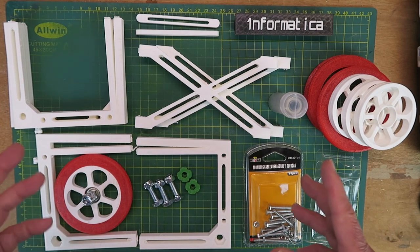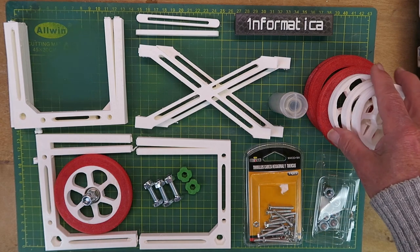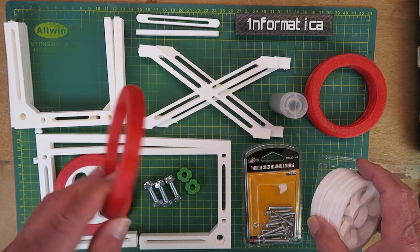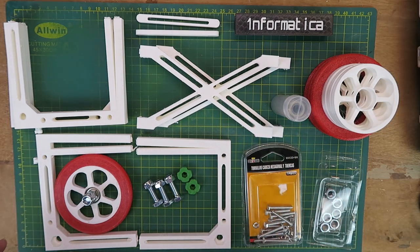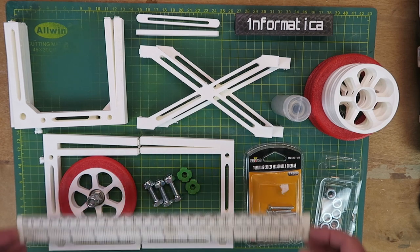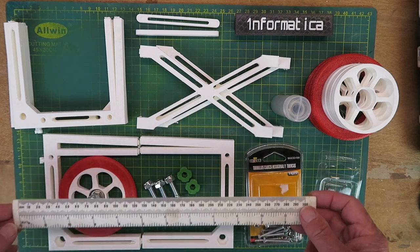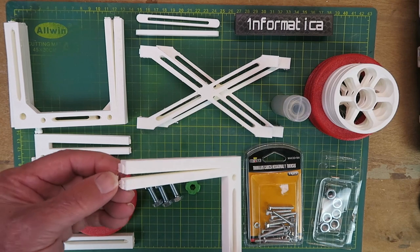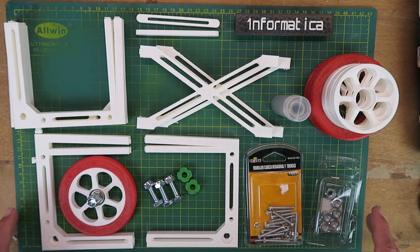Here are all our ingredients - I sound like one of those cooks off of the interminable cooking programs which I detest. However, I've printed off all the parts that we need. We have our wheels here. I've printed the tyres out of flexible PLA - you could also use TPU. I have my bearings here, the cross pieces, and the various other hardware that we're going to need. You'll notice that I've printed this in two sections. The only way you're going to be able to print this in one piece is if you have a printer with a bed of, I guess, 240 to 250 millimetres. I do not possess such luxury, and therefore I've had to print these parts in two. We still have, fresh off the printer, the support materials for the holes and things. First, I'll get those parts cleaned up and we'll start the assembly.